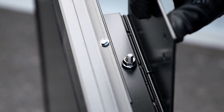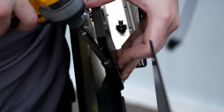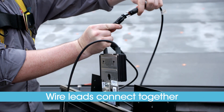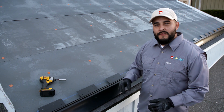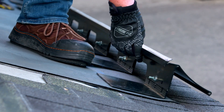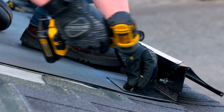Each panel has five adjustable feet bases that are bolted on with self-tapping hex bolts. There's also an MLPE bracket that attaches at this point to support the power electronic piece. This GAF solar energy system has 12 panels — three rows of four. The starter bar gives the system its strong foundation. We line it up to the chalk line snapped earlier, and once we're sure it's aligned and leveled, it's screwed down to the deck.